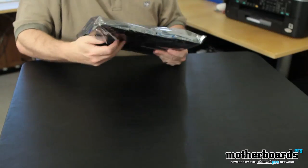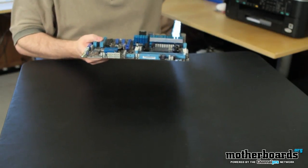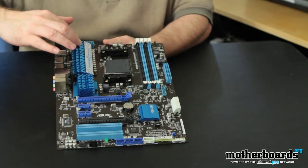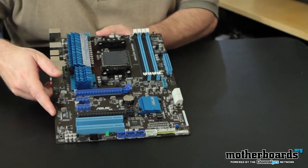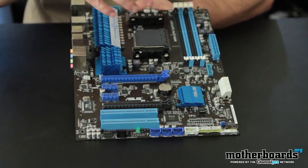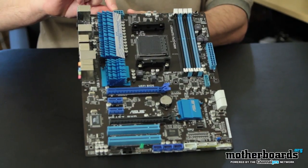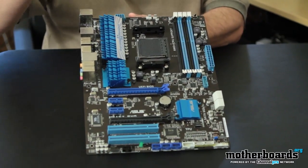It's a full-size motherboard, pretty nicely colored. Go ahead and pull it out. You can take a look at the motherboard. Start out, you can see it's very well made. It's not quite as heavy as some of the other boards I've taken a look at, but it's not light either. It's got a good cooling solution all the way down the side here. Let's see, it says dual intelligent processors. You can take a look here. Around the ZIF socket, there's plenty of room for using your aftermarket parts and everything. So if you want to use an aftermarket CPU cooler, that'll work there. You can see it's also high quality Japanese capacitors all the way down, low ferrite chokes everywhere around the board as well. Also on the board, here's the 8-pin power. And then we have two different pin connectors here for two different types of CPU fans or cooling fans you want to use inside your system.